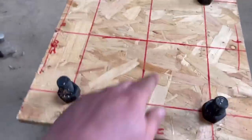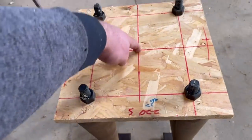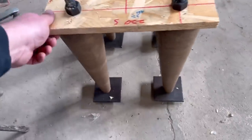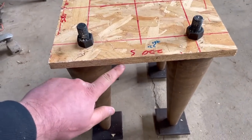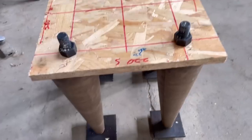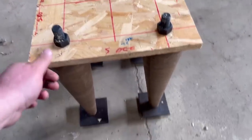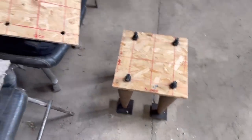And then we've got a centre thing here, which is where the bloke comes and he puts his little staff to make sure they've got them in the right place. So yeah, we'll sit these into the concrete. The concrete will come up to this level here, and then when the concrete's gone off, we'll take the bit of wood off, which will leave our bolts in the right place. So we've got about 12, obviously we have one for each stanchion. So yeah.